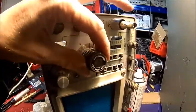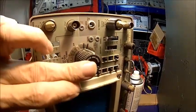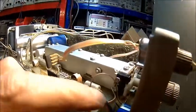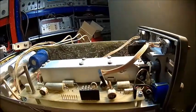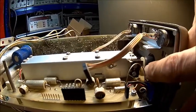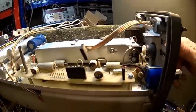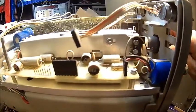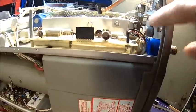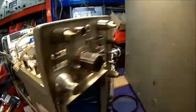Setup of this end is a bit tricky. You're going to set it flush to the marking, make sure everything is fully in, push it in as far as you can, and then tighten the two screws here. Make sure when it's in that the micro switch here has full contact. Now you can hear it's on B trigger, and the micro switch is already in — that's what we want. Move it around: you don't want to hear a click, otherwise you need to adjust this screw to get it in and out.